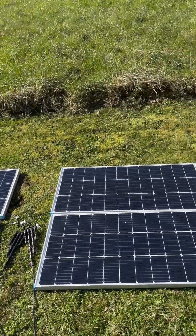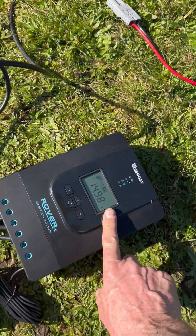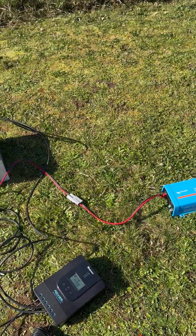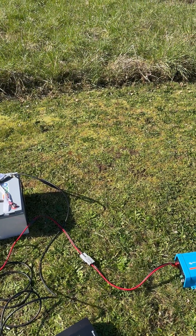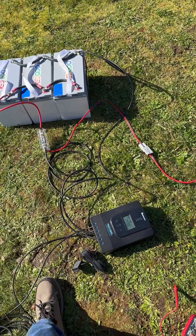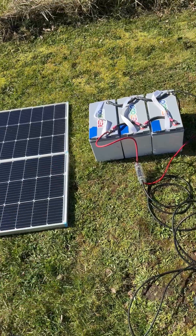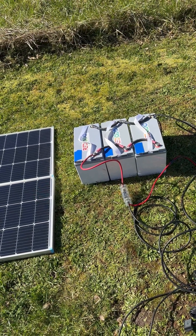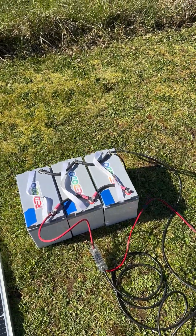Still, this is a good start — definitely better than nothing. These are nice kits. One thing I did have to do is go through the manual and select lithium iron phosphate battery type. It'll charge somewhat on the lead-acid settings, but it'll work much better on the lithium iron phosphate setting because these batteries run at a slightly higher voltage, which also means 12-volt equipment will work much more efficiently off the lithium iron phosphates than off lead-acid batteries.